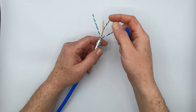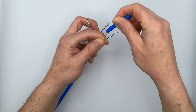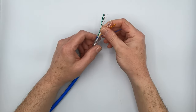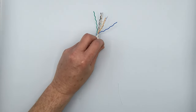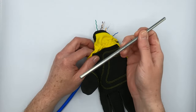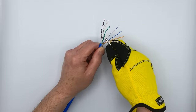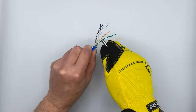The next step is to untwist the conductors, and the piece of cable jacket you stripped off earlier is a very good tool to do that. Start them with your fingers and then simply untwist each pair for all four pairs. Once you get all of your pairs untwisted, the next step is to remove the kinks in the conductors. The best way of handling that, especially with these thicker 23 AWG conductors, is to use a smooth metal dowel rod like this — a screwdriver shaft — and a work glove. Run each conductor between your thumb and the rod, starting at the very bottom at the cable jacket. About two to three passes is enough.